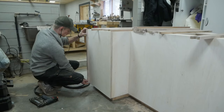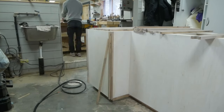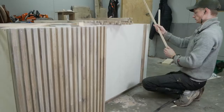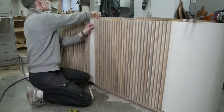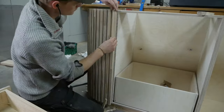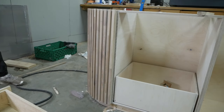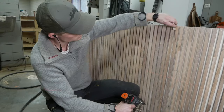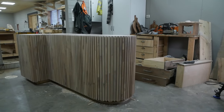After hours of sanding and finishing, I could now start to install the oak strips using brad nails and a 12 millimeter plywood distance block — and this was very satisfying. I set up a laser just to get the middle line of the brad nails straight, and again used the same distance block to get the right spacing. At this point I am stoked — this thing is starting to look really good. But my excitement did not last very long.